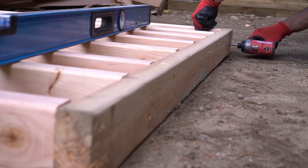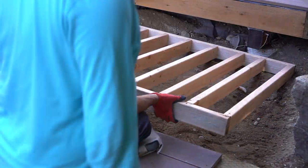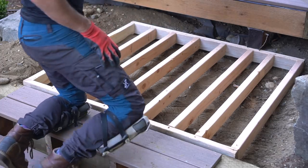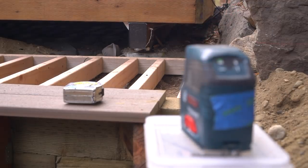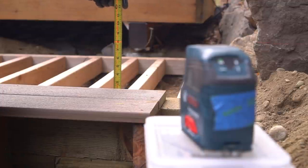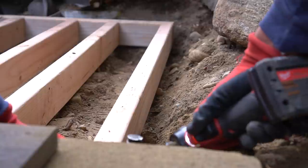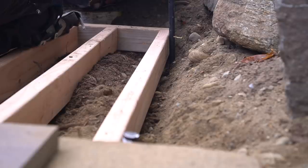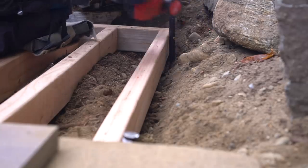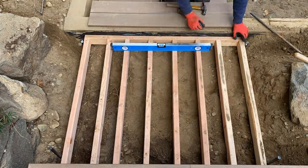We previously built an amazing deck and retaining wall, but there is approximately a four-foot gap between the two. We need to figure out how to connect them with a landing. I built a formwork system for pouring concrete, sectioned off in four different sections. I use a laser level to determine the exact height needed for the formwork to meet up with our existing stair treads. I hammer in steel stakes in all four corners and fasten them securely to the framework.